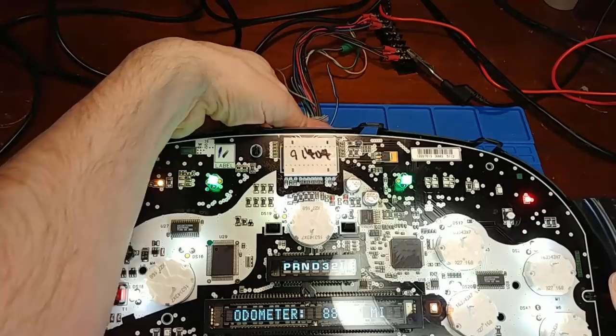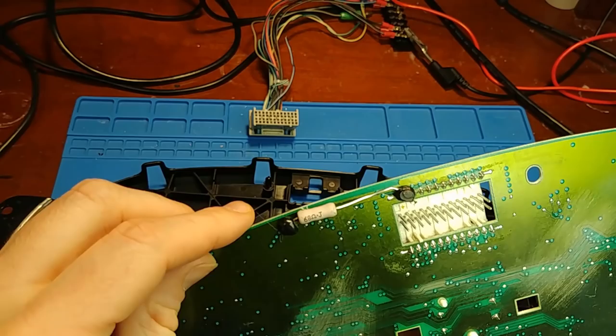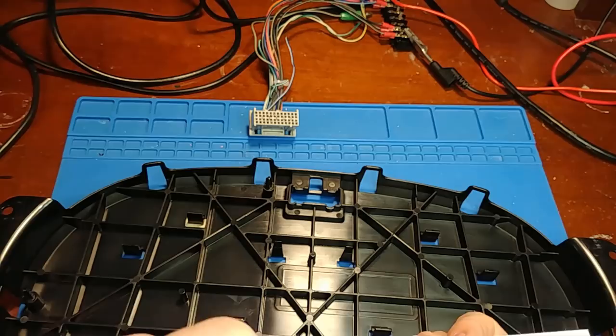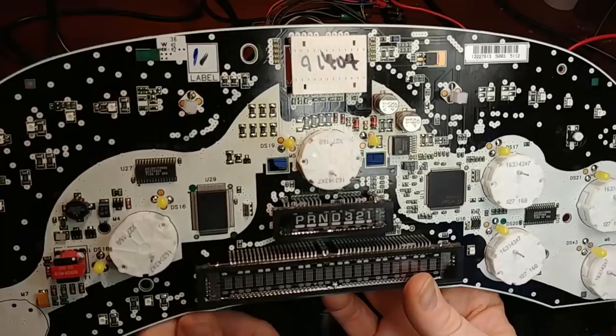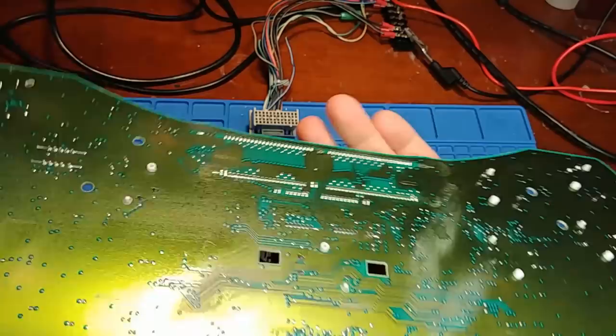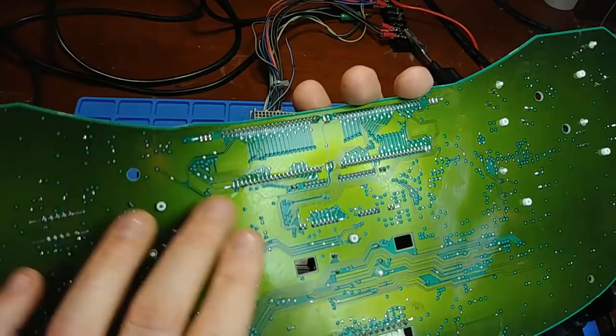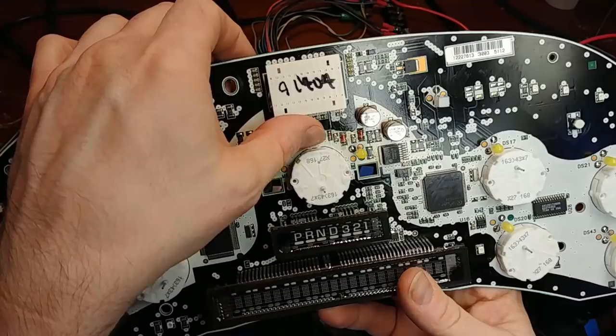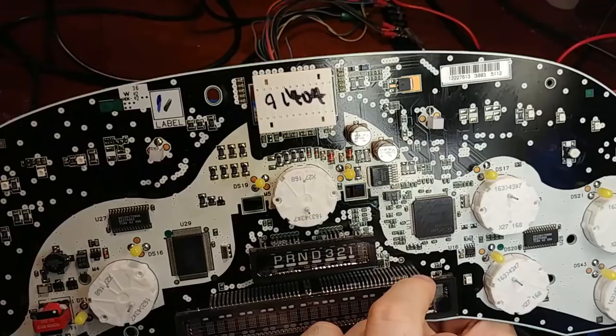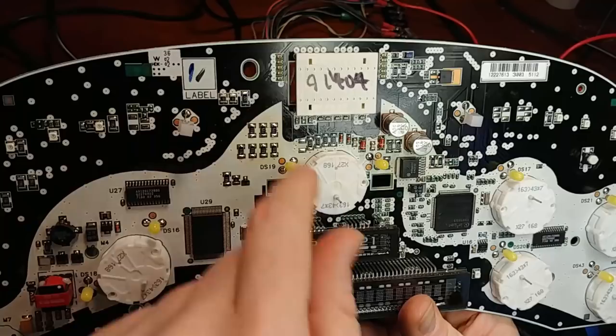X27 — that's good. On the back of the circuit board it's a 68-ohm resistor. They just cut the traces for the backlighting and put a resistor in-line so they don't need an individual dropper resistor for each LED. I do see they've reflowed it — it almost looks like there's a conformal coating over this too. They've also sanded down the possible growth on the back of the circuit board. They've reflowed all the common issues, including this resistor over here by the power supply.